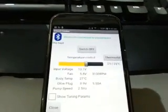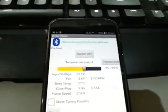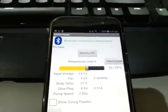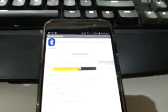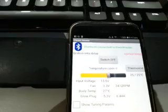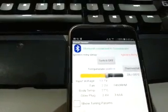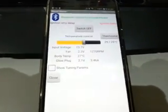I've added some logic to this Android app to report that the retry is actually taking place - you don't normally see that on an LCD. My particular controller does not report if it failed to ignite at all; it just goes back to standby. So here you go - it's just timed out. I had the ignition retry error message, and this message to the left is actually coming out of the heater saying it's delaying before retrying again.